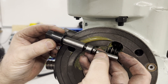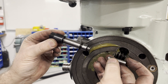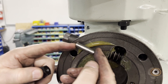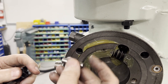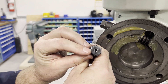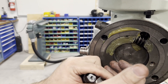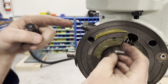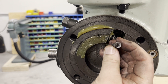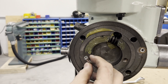As a repair tech, I have to extract this portion of the shaft and then go deep inside and extract the stub of the shaft out through the hole. It's a blind hole so I can't push it through — I pull it out by drilling and tapping the shaft and using a slide hammer. I have a long drill and a long tap, go deep inside the hole, drill and tap the stub, get a bite on it, pull it out with the slide hammer, and then put the replacement parts back in.